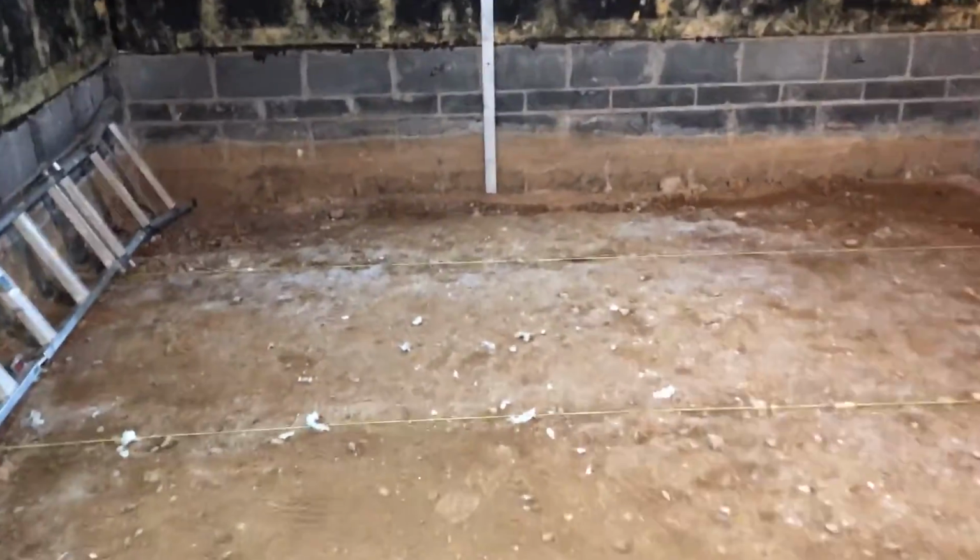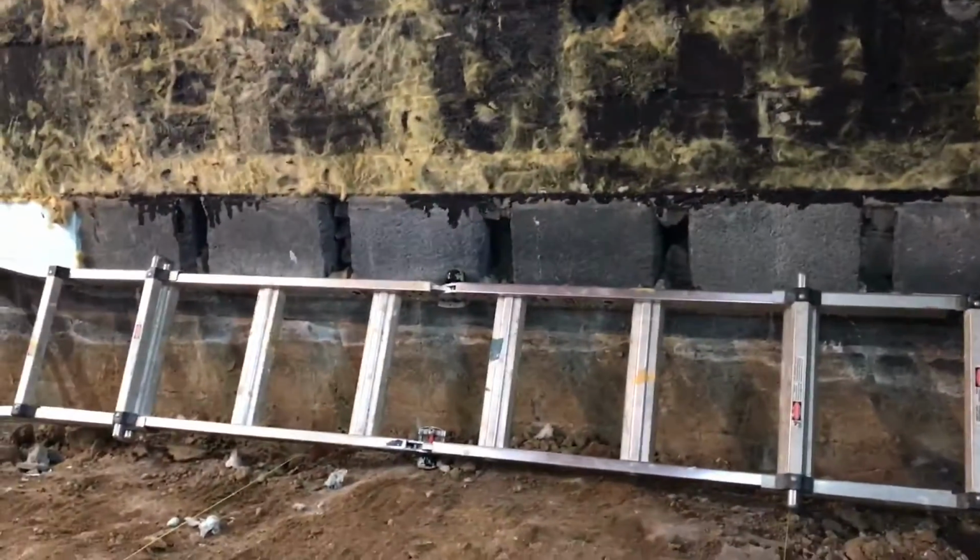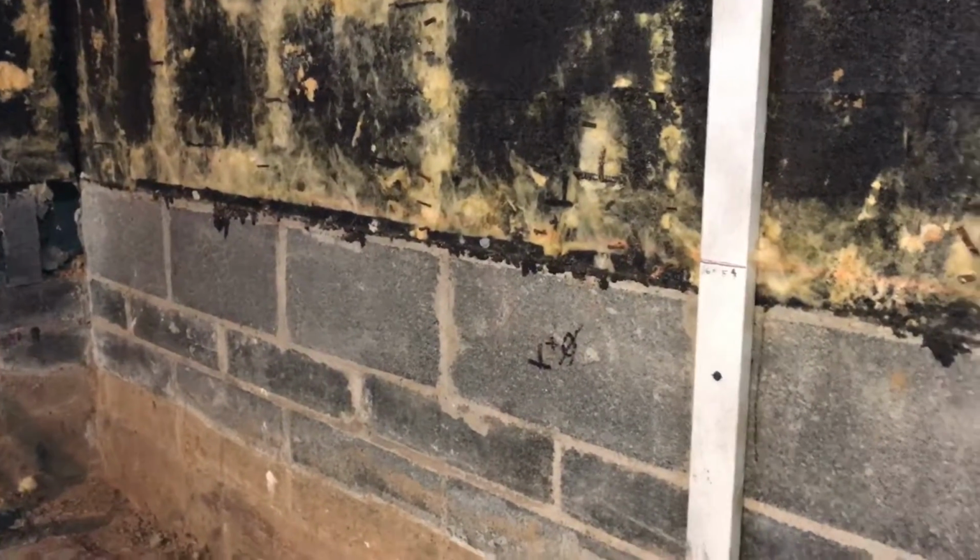And then over in this room, we've done the same thing. We've got a storyboard on the wall, and we've got that line marked. So now we have a line in each room that is the same height as the top of the foundation wall in the additions. So we'll build porch style piers inside of this room and the other room, so that with sills and floor joists, they'll match up with the floor in the additions, theoretically. So we'll keep you posted. See you next time.